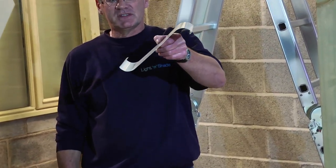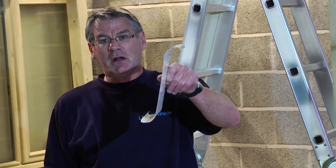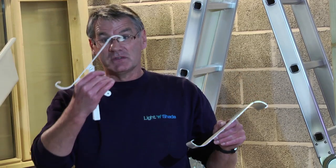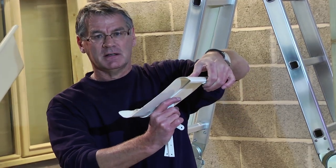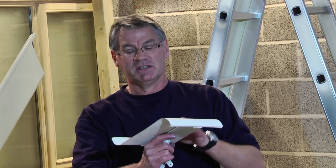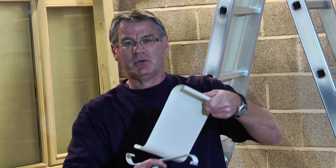This is the profile of the louver. You can see it's shaped like an S, or a plain pantile, and it's that profile that gives the roof its weather tightness and weather security. The way the louver fits onto the louver clips on the roof is very simple — it's offered up into the louver clip, squeezed, and clipped into place. That's repeated all the way along the roof until all the louvers are in position. If you ever need to get above your pergola for maintenance, simply reverse the process, unclip the louver, and you'll have access between the louvers to get a ladder up against the wall.